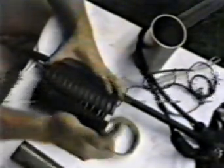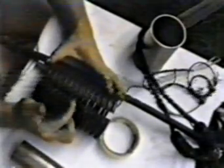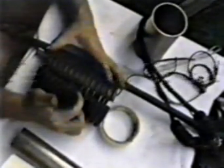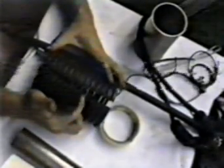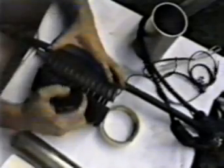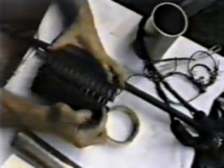I looped my positive across to this side. I got gas in there, which made one unit. I then looped it to the next centre, the second plate up this end. I got gas in here, none up that end. I looped to the centre. I got gas on inside negative, two neutral plates on both sides, and inside positive towards negative. None up this end at all.